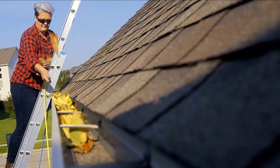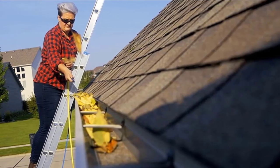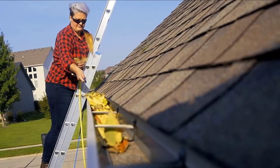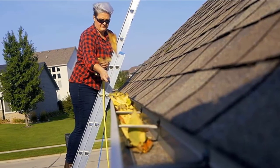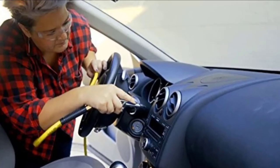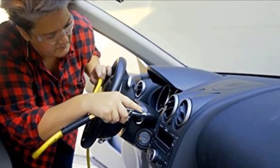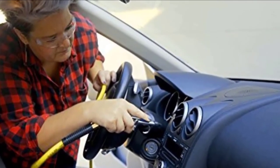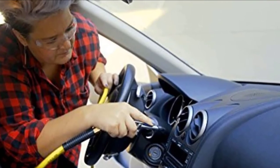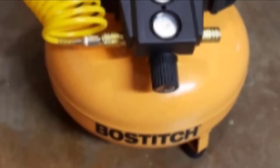It features a highly efficient 78.5 dBA motor that is so low in noise levels to the point that you will hardly notice its pressure at work. The 22.7-liter capacity tank provides you with enough storage space to drive your tools. The compressor features a 0.8-horsepower motor that is oil-free and maintenance-free and is portable and lightweight with a prolonged lifespan. It generates 2.6 SCFM at 90 PSI and maximum tank storage of 150 PSI for long tools runtime with quick recovery.